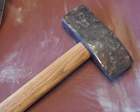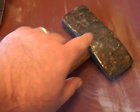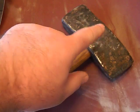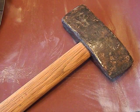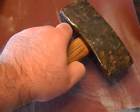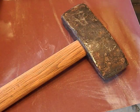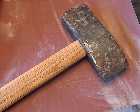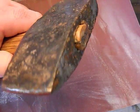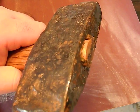Normally, because the bottom is smaller than the top, if you're able to squeeze through the bottom, then usually at the top you'll have plenty of room for that wedge. I was able to get this thing all the way in and have it come out proud, but not have enough room for a wedge, so I had to go back and remove a ton of material off the handle just to make it wedgeable, which made the top of the handle very, very thin. As you can see, there's very little material up there, and it's a huge wedge, which I don't like.